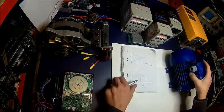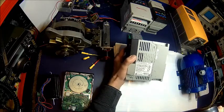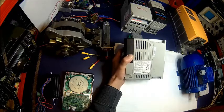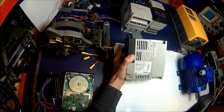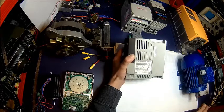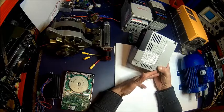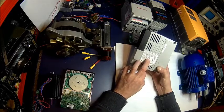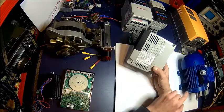What does an inverter drive do? Looking at the nameplate of this one: input 380 to 480 volts, 48 to 63 Hz — so it doesn't matter what mains voltage or frequency you have, this thing is happy with everything. The output says 3-phase, 0 to 240 Hz, AC voltage range 0 to 460 volts. So this box provides us an output frequency from 0 to 240 Hz, meaning we can reproduce virtually any mains in the world, and the output voltage range of 0 to 460 volts accommodates everything on our nameplate.